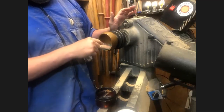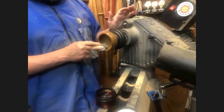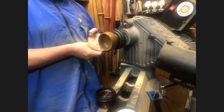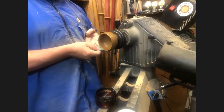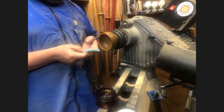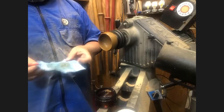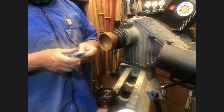I've said on several of my videos that it's more acting like a friction polish. Isn't it more acting like a friction polish? Not exactly. Well, maybe, yeah, not exactly. Toward the end, maybe more so, but at the beginning, you've got an awful lot of abrasive in here, so you're actually sanding. None of the manufacturers that I've seen have said anything about this being a finish. This is a part of the sanding process.